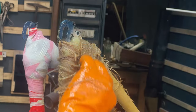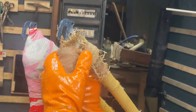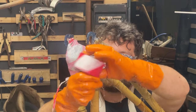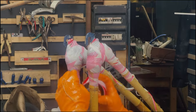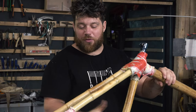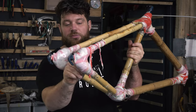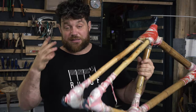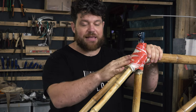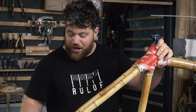I do this procedure everywhere on the bike frame, including the back side where I use smaller fiber strips. This area is getting much harder treatment because all my weight sits on top, so it has to be an extremely sturdy part of the frame. I apply the tape all the way around. The bike frame is ready and it's so lightweight — it feels like an aluminium one. Now I remove all the red tape I put on very tightly to squish as much excess resin as possible and eliminate any air bubbles formed around the natural fibers — fewer air bubbles means a stronger frame.